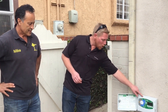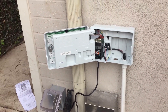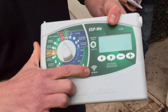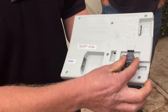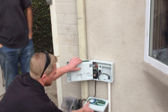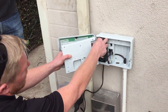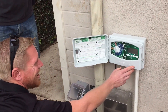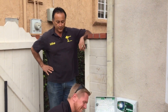What we're looking at is one of our older versions of the ESP-me controller — a modular controller. What we've done is made a few changes so we can simply switch out the faceplate. The new faceplate is ready to accept our LNK Wi-Fi stick, which goes right into the accessory port. All we need to do is swap out the faceplate: unplug the ribbon, take the faceplate right out, plug the ribbon back in, and insert the new faceplate. And there it is — incredible, that's it!